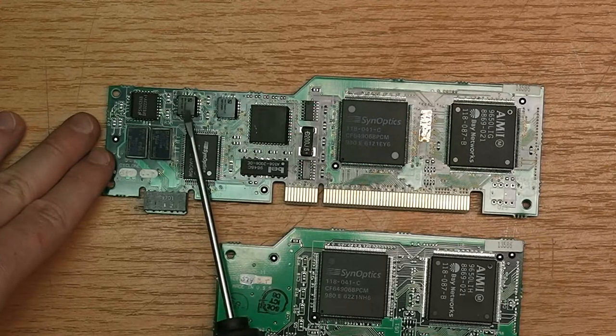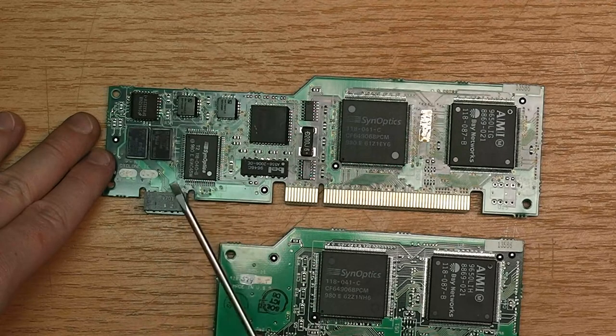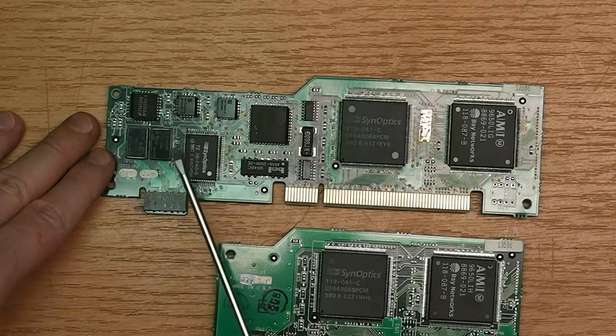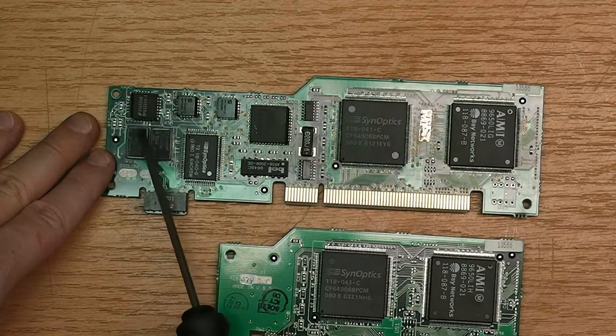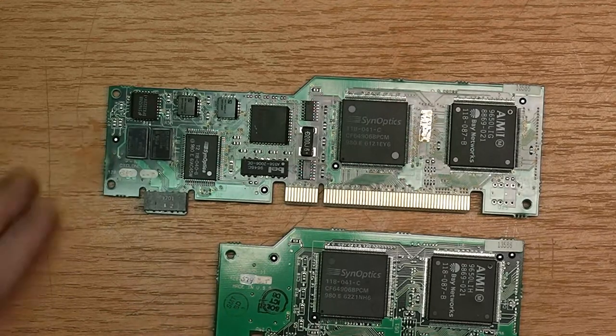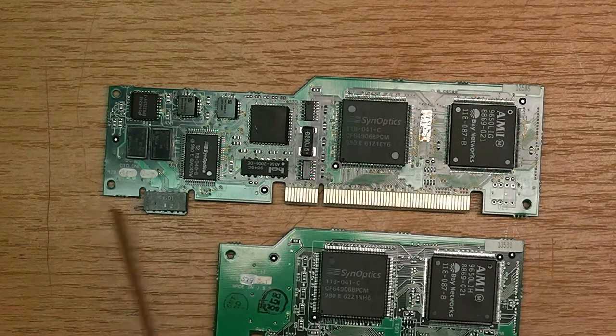And then after the PHY, there's the transceiver, which is a Dallas part, standard part. And interesting, after the transceiver, here are two reed relays. I'm guessing those are the ones that you also heard when the switch booted up. Those are for loopback testing. So basically, you can short circuit the RX and the TX, and the device can do some self-testing if everything up until here is working correctly.